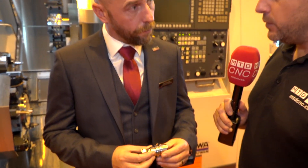Finally Shane, when you go into an engineering company and try to identify a need for this type of machine, is it when you've got a part where you feel like you could get the second operation for free? Yes, absolutely. It does suit more of the medium to high volume work as well, and if you put on inline gauging, you could set yourself up a really good cell, really showing consistency of parts.